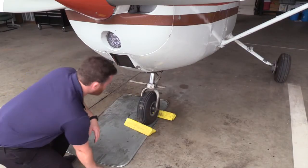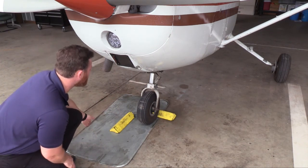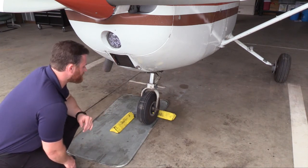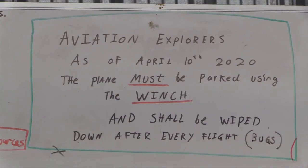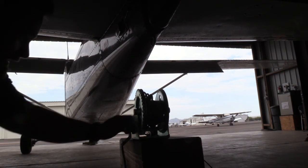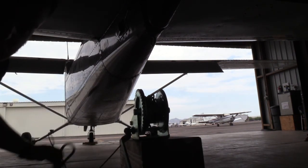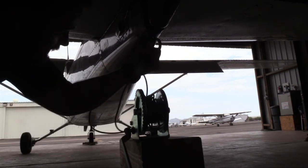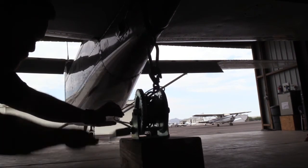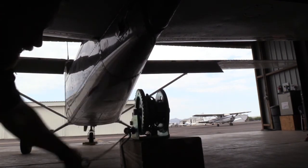While we're here, we can go ahead and remove the chocks. On this airplane we can just keep them to the side — they will not be hit by the gear. As you step this plane back into the hangar using the winch, it's a really good way to make sure we're stopping where the airplane needs to stop and that we're over the oil pan just in case it does drip. With the Aviation Explorers, we are required to use the winch to pull the airplane back. The first step when pulling the airplane back in is you disengage the latch so you can pull the cable out freely. Once you have enough room, take the big carabiner, attach it to the tail hook carefully, then reengage the winch and start cranking it back. Once it's in and over the hump and securely in the hangar, disengage the carabiner off the tail hook and put it to the side.